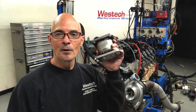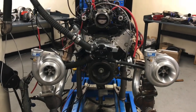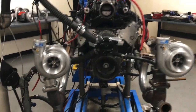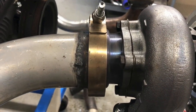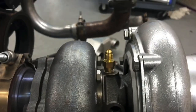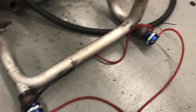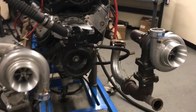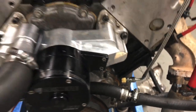Why would I spend an hour or two fabricating a piece that I already have rather than drive to my storage and pick it up? Okay, we've got the other turbo mounted on this side - look at that. Tom Nelson, where are you at? Symmetrical turbo! Check it out - got the exhaust mounted. These take a little adapter flange, four bolt to a v-band. Now we just have to orient this and get the oil feed the right side, get the drain. This one's oriented properly. Get our wastegates on - got to take them off of here and get them on here. Once we've got that, we've got to split the oil feed line - we're running the oil feed line from right down there, so we'll split that to these two fittings.